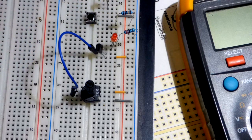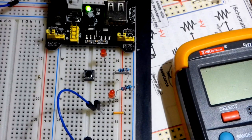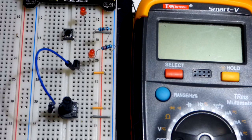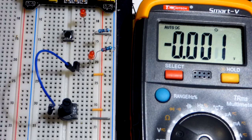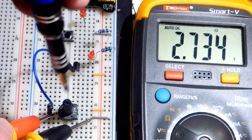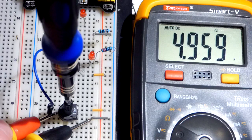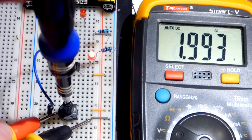Now up here I have a mechanical switch, and we will control it with the mechanical switch instead. We have the 5-volt power supply there. Let's take a look at the voltage that we're getting - this is something important to learn about voltage dividers using a trim pot. The voltage changes based on the position of the trim pot. About halfway we're at about 2.5 volts. Turn it all the way up to the positive rail and we have 5 volts. The LED was flickering as I was losing connection at some point. Now we lower the voltage and the LED turns on.